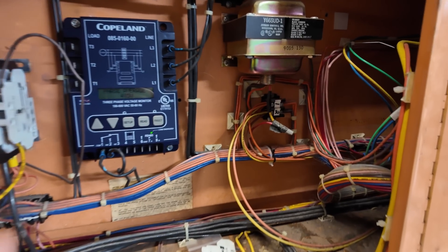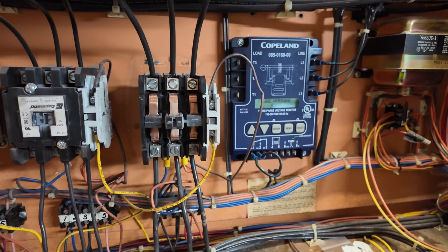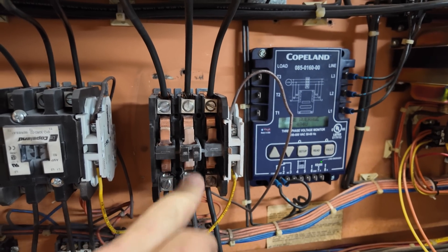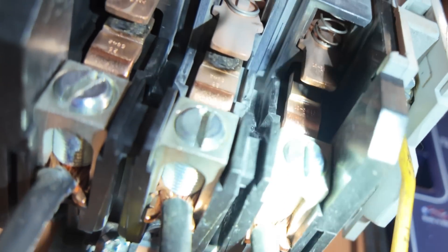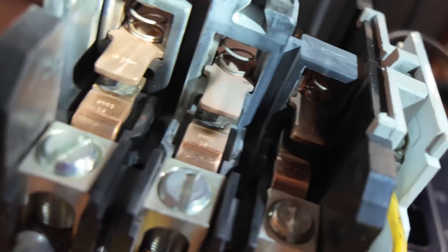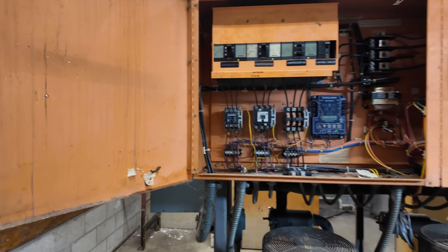The problem with this device here is we don't have it wired up to actually monitor the other side of the contactor, because you'd have to have one on each one of them. So what I want to do now is check this contactor and see if it's pitted. You can see there's a burn mark right there on the bright side a little bit — definitely a little something in there. Was it enough to single-phase the unit? I don't know. Is that even the problem?